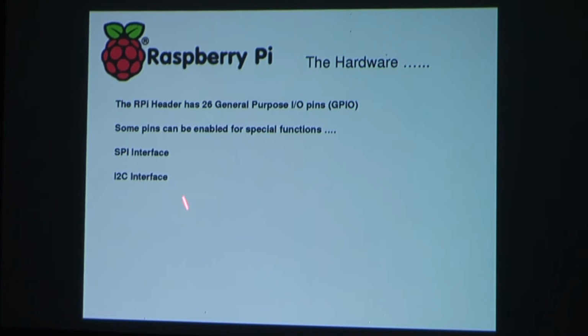Next one is the I2C interface. Again, another serial interface that you can program, it generally runs about 400 kilohertz. Because of the internal architecture of this, you can get 120 devices in a drop bus. It's a bus architecture. You get 120 devices addressed on this, and you can go out about 300 meters, which is 1,000 feet. You can go and go and go.